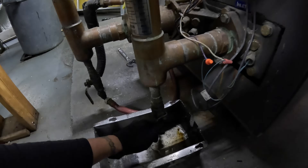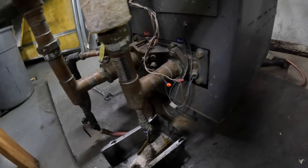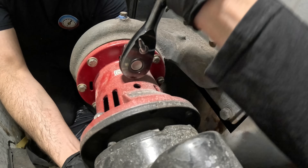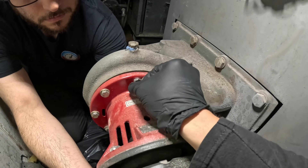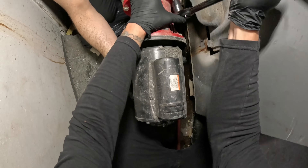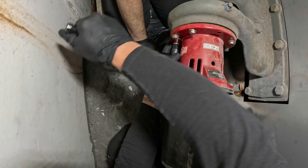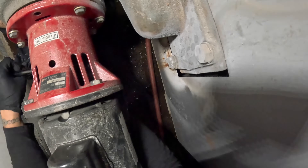You could take out a water pressure gauge or something to push air through it, but I'm just gonna crack this open. Now we have water flowing through — not much. You want to make sure these valves are holding so you don't get hit with that. I've got Chris on this side. We're going to balance the motor so this thing doesn't break. We're pretty much going to loosen up all these bolts and pull this thing out one by one — don't lose your hold until there's about two bolts left. Let's pull out these bolts.